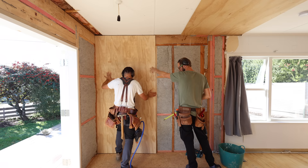Of course, it's not as simple as just nailing or screwing a piece of plywood to the walls. You have to make sure those walls — the framing of the walls — is substantial, is enough, and built in a certain way to be a bracing wall. There are bolts that need to go into the bottom plate, and those bolts need to attach to something.